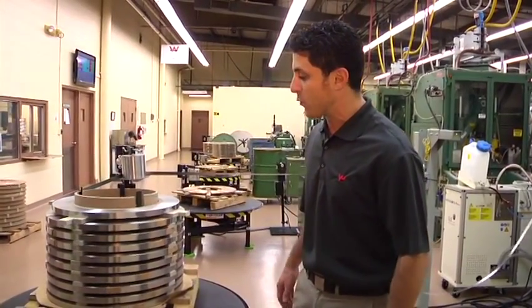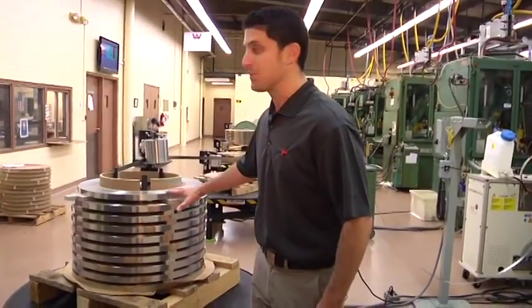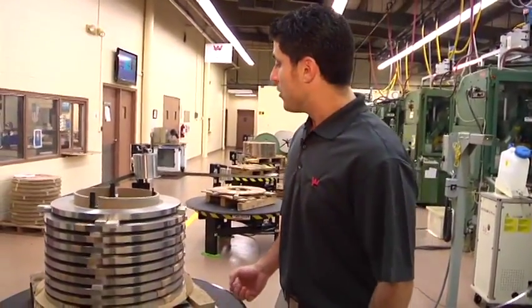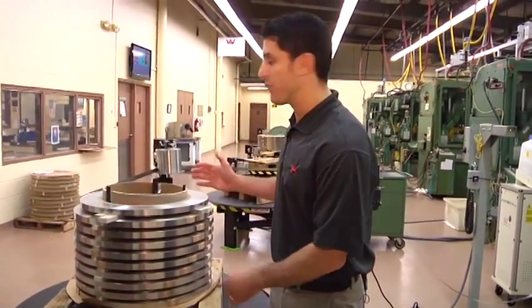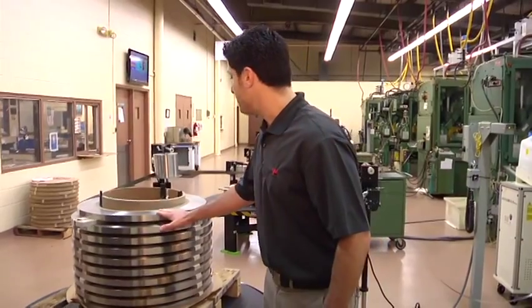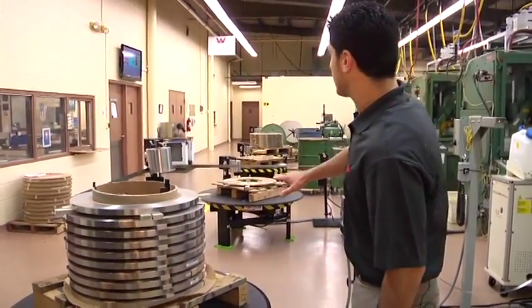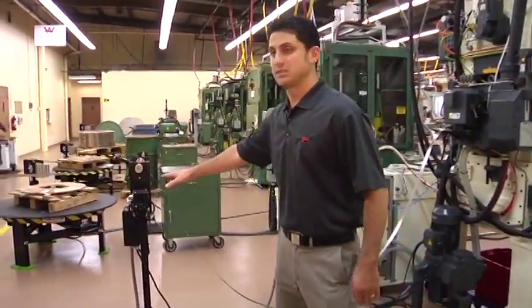The other reason is it's a very quick setup. We put this skid on via forklift and the stacking material is here. And number two, ergonomically, the operator does not have to handle the large coils by flipping them over vertically, so we stack them on top. The material is then paid off the horizontal payout counterclockwise through a feeder system.